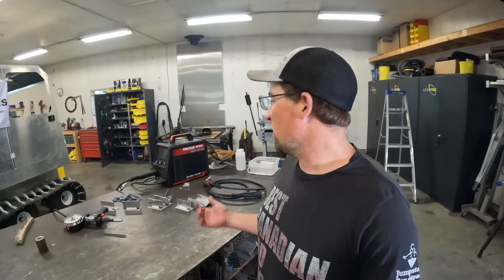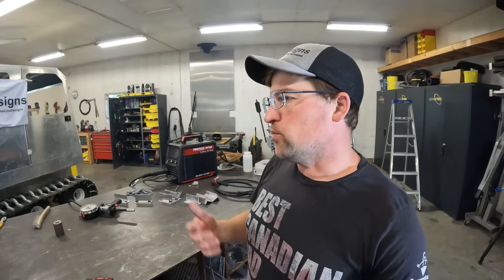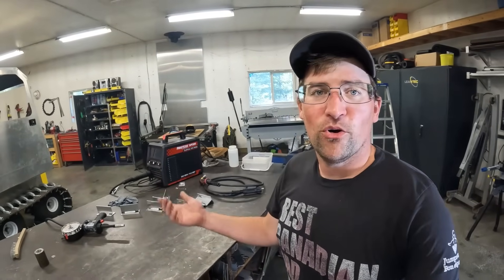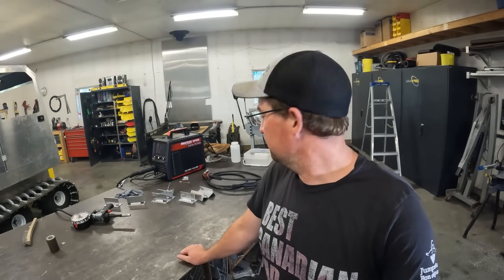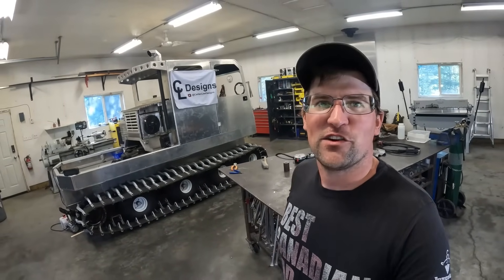There we go — some dual pulse MIG welding on aluminum with the DP-200. The factory settings are a good starting point and depending on your specific job you need to learn to dial them in; that just comes with the territory. Spending a little time, going through some billets and tips, I found the settings I liked, and I think we can further tweak that — that's the beauty of this machine. You can really dial it in and all of a sudden you're laying down really nice welds. Overall I'm very happy with this machine. I think it brings new opportunities to a home shop, and if you only have to buy one machine, this can do a lot of things for you. If you're curious what we're building, we've got a whole playlist on our custom snowcat build — check it out, there's a ton of aluminum welding in there. Thanks for watching everyone, we'll see you in the next one.